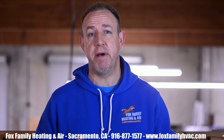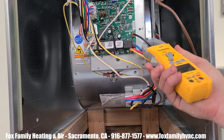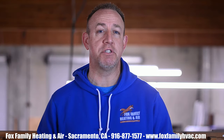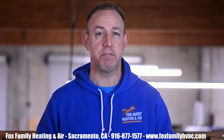Or it could still spin but have an open winding inside the motor, which isn't allowing the circuit to be complete. Check the amp draws and compare them to the data provided by the furnace sticker. Sometimes you have to use a mirror or actually pull the motor out to check the amp rating of the motor. If you have access to the service facts manual of the furnace, the OEM motor specs will be listed in there as well.